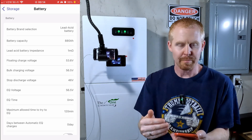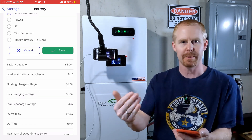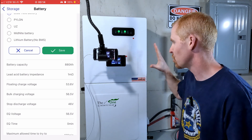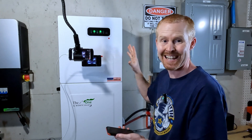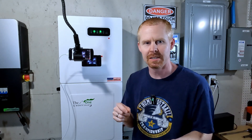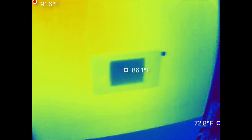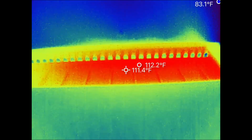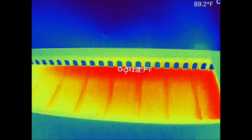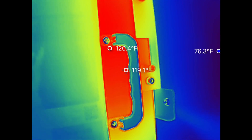So I went in and switched the battery mode to lead acid. I left the bulk charge voltage and changed the float voltage, bringing it up from 48 volts to 53.6. The fans just turned off and we still have about 3 kilowatts on each leg. The fan is still only running when the unit gets hot. I recorded with my infrared thermal camera the temperatures while the fans were running: the front of the inverter was cool at 87–88 degrees, the top heat sink area was 112–114 degrees, the right-hand side was the hottest at around 120 degrees, and the inside was 98–100 degrees.